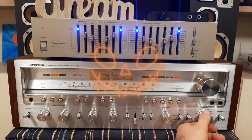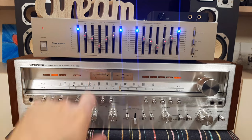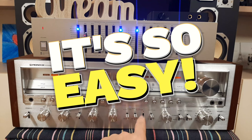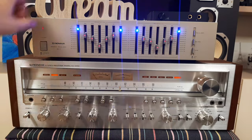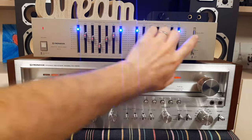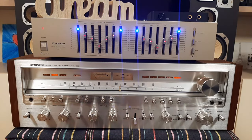Hello guys. In this video I want to present how to hook an equalizer with an AmpliTuner. This AmpliTuner is a Pioneer SA-6250 and this equalizer is a graphic equalizer from Pioneer. The equalizer is connected on tape monitor number 1. I will show you how to connect on tape monitor number 1, tape monitor number 2, and on the adapter switch.